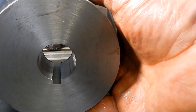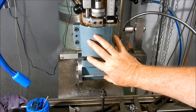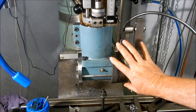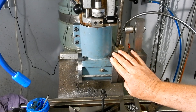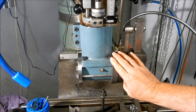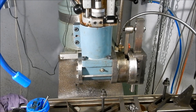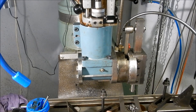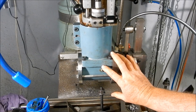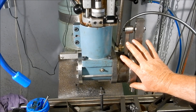As with all Bridgeports, rigidity isn't their strong point, and certainly with this head mounted on here I need to take it fairly slow and be careful how I step the cuts. I'm going roughly 0.04 to 0.05 millimeters per step, and that keyway took me around about eight minutes to cut. Rigidity isn't a strong point of these machines with the horizontal head and the further out-lying ram.